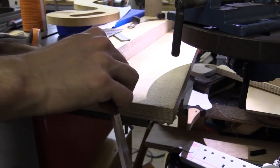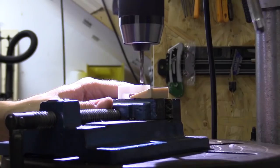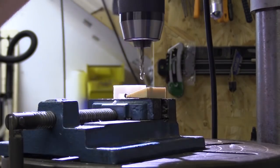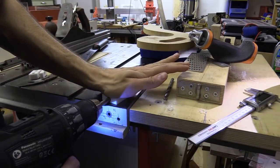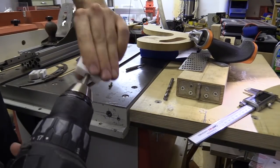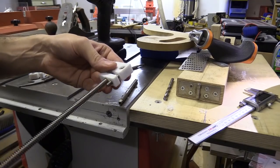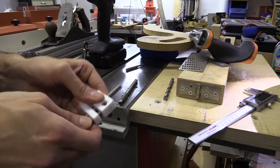I decided to make my own tap because I've noticed that there are slight variations depending where you buy the lead screw and blocks from. Some just don't fit at all despite being listed as compatible. This is because some threads are square while others are rounded. Even some lead screws and nut blocks sold from reputable places can be quite difficult to thread, so for the best result I found making my own was the solution.